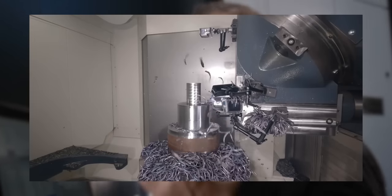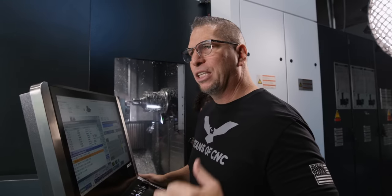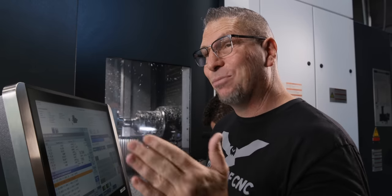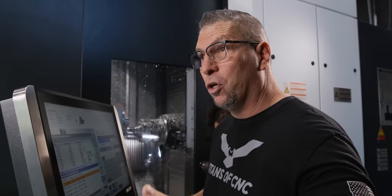We put out a video with the CP6000 just murdering chips. What I really noticed when Barry was making that cut — and it was an aggressive cut, 90% axial, three times D, 90% radial, in 1045 steel, a monster cut going nonstop — was the sound of the machine. There was no stuttering. It was just a smooth, silent aggression. You can go all day with those cuts, and it's crazy. And he did that without coolant. That's insane.